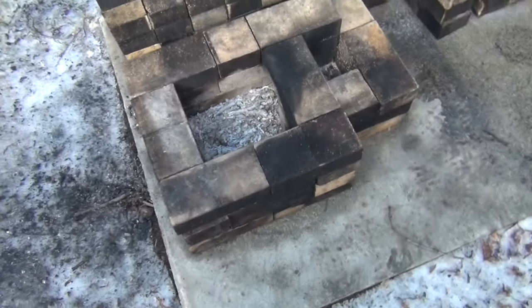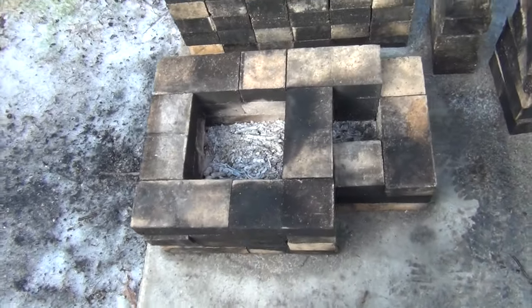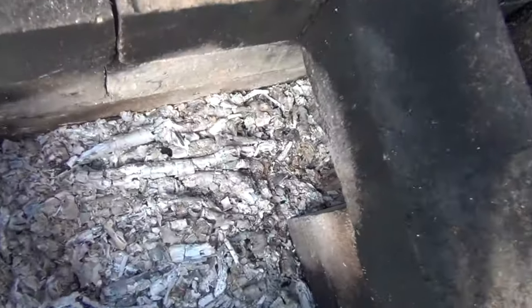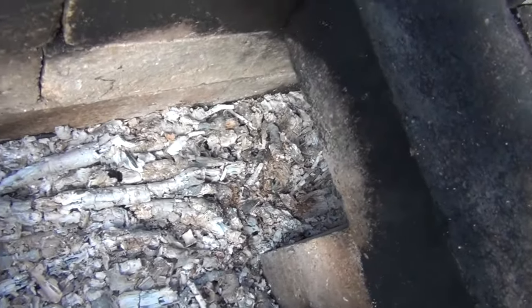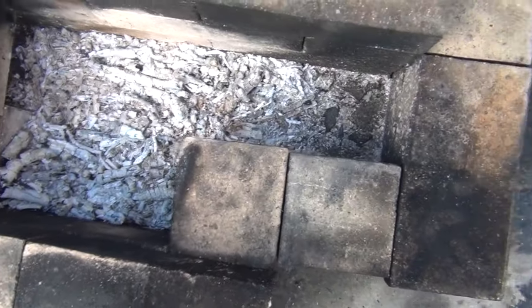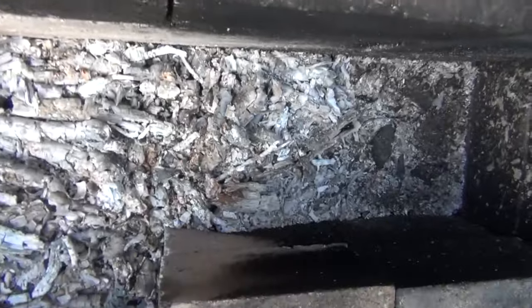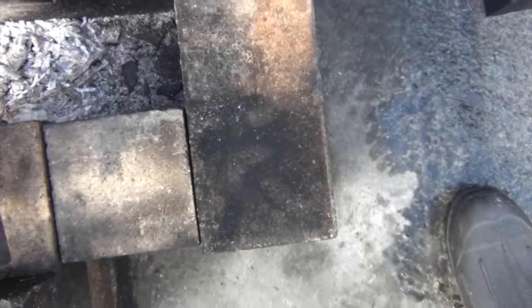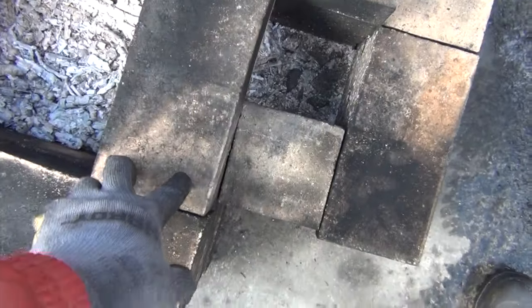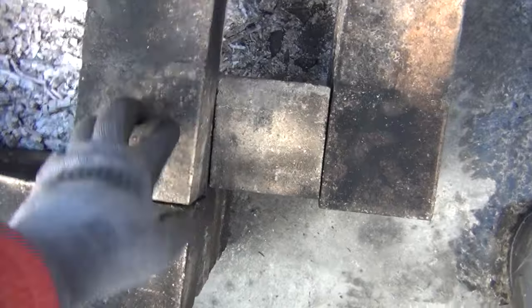It's always funny when you get to the base, you go, that's it? That little tiny thing. It always looks like nothing when you get to the base. But see, to get to the riser there, it's just one brick across. It's 2 bricks high, but you just put one across, and that's it. This is only half a brick, 4.5 inches. And then, once you start laying across, it just stays in place.